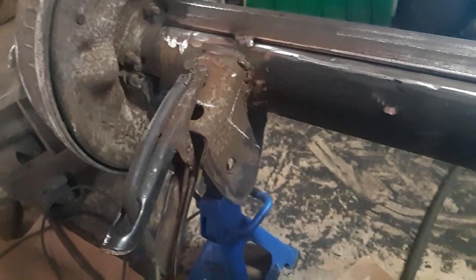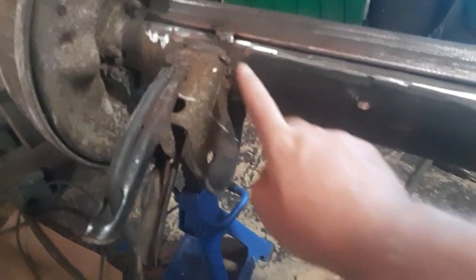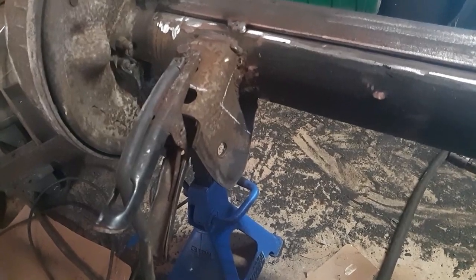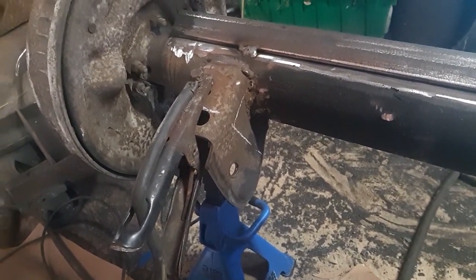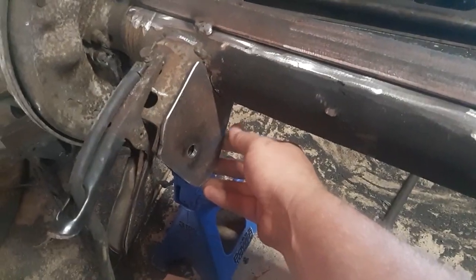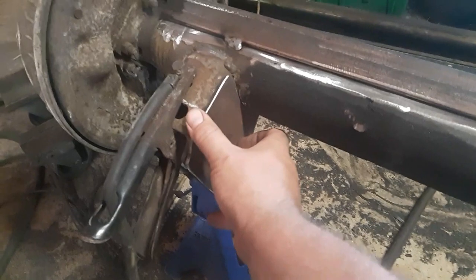which deterred me for a few seconds, and then I just decided to suck it up and bend a piece of metal a bunch of different ways. Probably gonna grind some of that out of there too. That's some good old factory welds. Bend it up a bunch of different ways. Got it to fit pretty good where I was happy with it, and then I'm gonna weld it in. Pretty much just slap me a piece of cardboard up there. Boom, had a template, and then boom, had it cut, bent, all ready to go. That easy. So I went ahead and did the other side too.